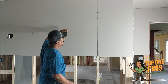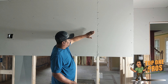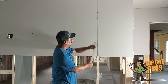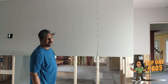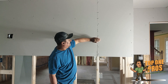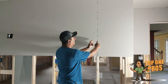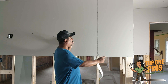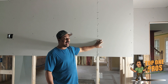That will help prevent leaving a hump on the drywall. If you put the tape on and just apply a little compound on both sides, when you shine a light on it you're going to see a hump right there. The farther you go from the tape, the more you'll hide it.